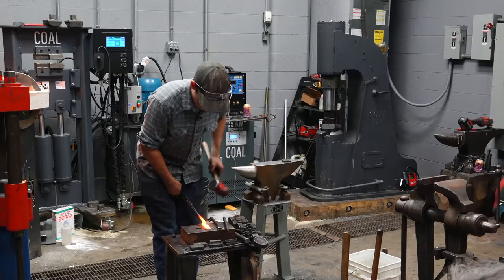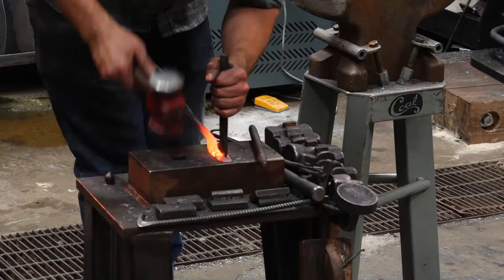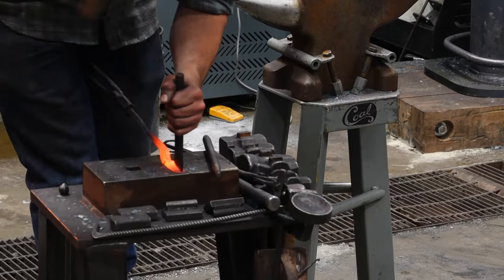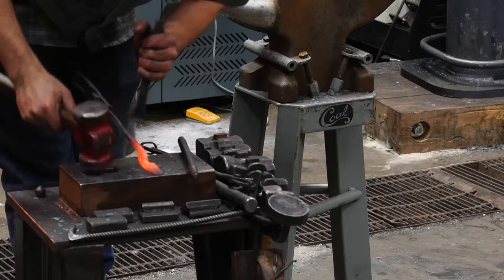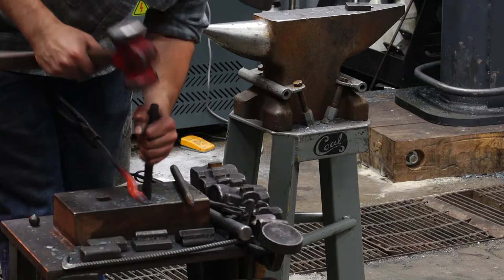Now I'm gonna put that pattern in the jaws I talked about. I'm gonna chisel down the very center of the jaw. I'm gonna do an X pattern. This is just the same thing as channel lock jaws, vice grip jaws. Just giving a little pattern that's going to help me hold things. Now I'll go through, clean up anything that I think needs to be cleaned up.